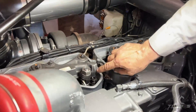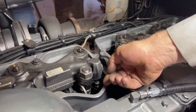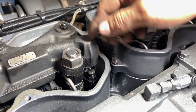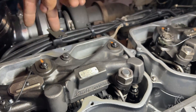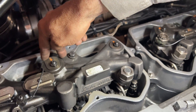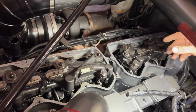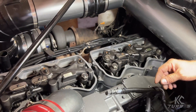There's a slave valve inside the housing here which comes down. As the valve rocker comes up, it pushes the slave valve back up into the housing, causing oil pressure to go over to the proper cylinder, opening the exhaust valves — causing that noise you hear in a big semi when you get next to them. They make that growling noise going down the freeway or coming up to a stoplight. This unit creates that negative power to slow you down, as well as the really cool noise that you hear.